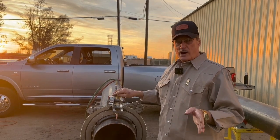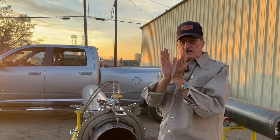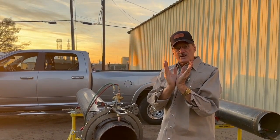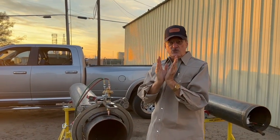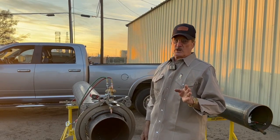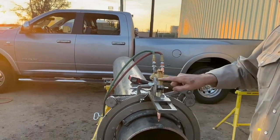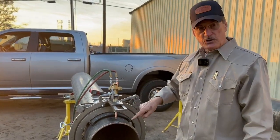If you're in a plant and you're doing low hydrogen, or you're in a school and you're testing to like B31.3 or whatever, it's 37 and a half degrees. So the bevels get wider. It's a lot easier to weld that low hydrogen when you have a wider bevel, and it's a little harder, especially if you're on that 6-inch schedule 40 — it makes an ugly weld in there. It's very hard to learn how to weld on 6-inch schedule 40 because the bevels are so tight, the rod puts a lot of metal, it's all humped up in the middle, then when you go to cap it, it's too high and ugly. Try a 37 and a half degree like you're supposed to on a job. Right here is where we adjust that, and right now it says 60 — it's backwards, because I'm coming off a 90 degree angle, so the 60 is a 30. It's a little counterintuitive, but 60 set here makes a 30 degree right here.